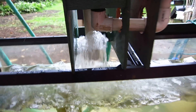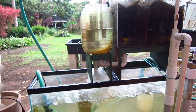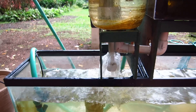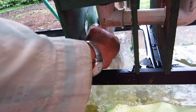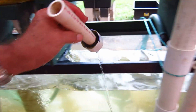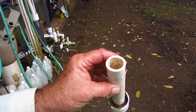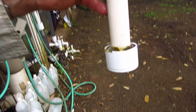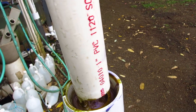Now is that cool or what? We've got it down - I can start a siphon with a cup of water. The whole problem I think people have is they don't have this little end piece down here on the bottom. I want to show you that. I'm going to pull it off and step out here in the light a little bit better. I want to show you just a one-inch piece of pipe, and down at the bottom I've glued it to a cap - a one-inch piece of pipe glued to a one-and-a-half-inch cap.